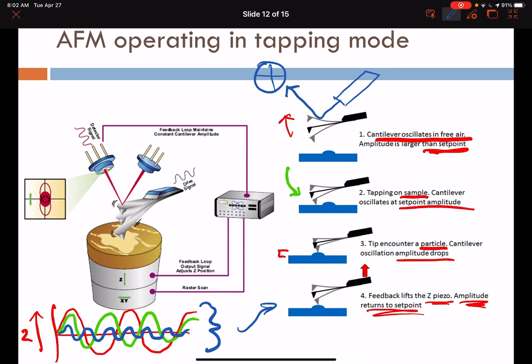In the diagram, we see a piezoelectric for the Z direction and a piezoelectric for the XY direction, both controlled by the AFM controller. The Z parameter helps make final adjustments of the cantilever position as additional topography is registered — in this architecture the sample is below, and we adjust sample proximity to the tip using that piezoelectric. To generate the XY plane of information, a second piezoelectric below moves the sample back and forth for imaging.